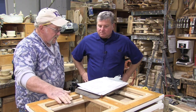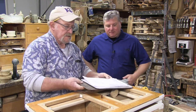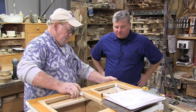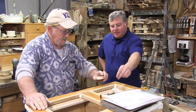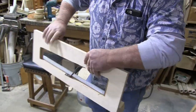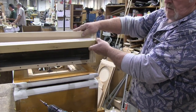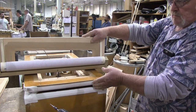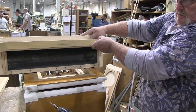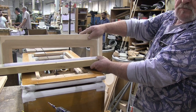These control the volume and pressure of the air between the blowers and the pipes. Okay, so the air comes in. The air comes in, and it's controlled by a curtain with folds that allow it to inflate. As it inflates, it pulls up that curtain, which then stops the air at the right level. And as you use air, the reservoir fills up. The top comes up, and as it does that, it pulls a rod which closes the curtain. And then as you use air, it opens the curtain back up.